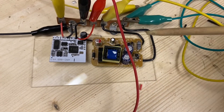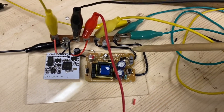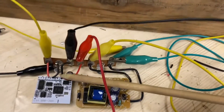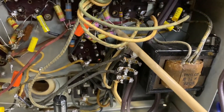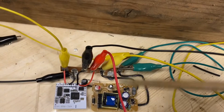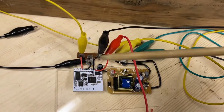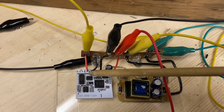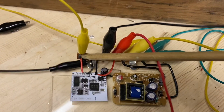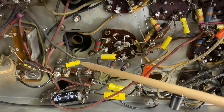Take it apart, take it out of the case — make sure it's running through a transformer and not wired directly some weird way, as these things come from China. So this is wired into this terminal strip. I've got AC coming in, going directly to the AC power. These wires here are for the LED light. The output ground will go to the chassis, and both outputs combined will go to the volume pot.